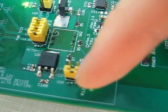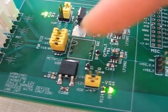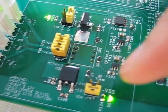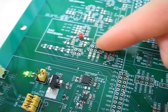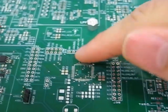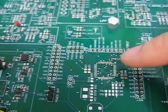I have an option to switch to the raw battery voltage instead of the regulated supply, but that's potentially an issue with drift over time. I'm excited about the next stage — working on the DAC and analog circuits — since I can get through that fairly quickly. The final stage will be the digital and coding part, which will take a while since I'm a little rusty on that.